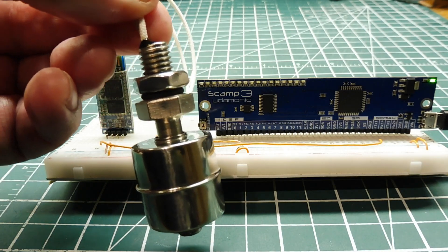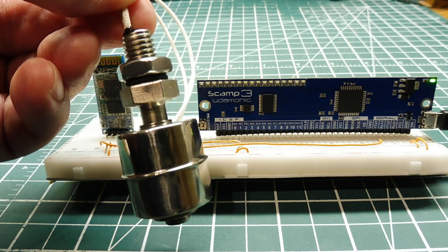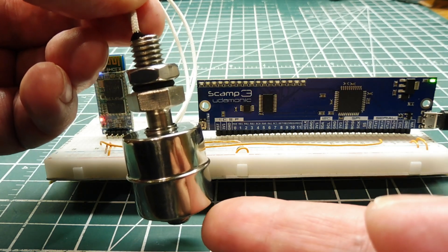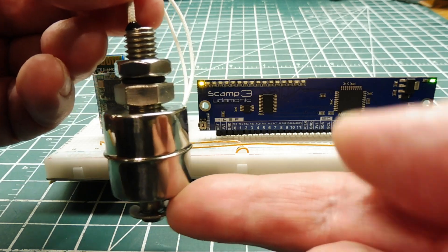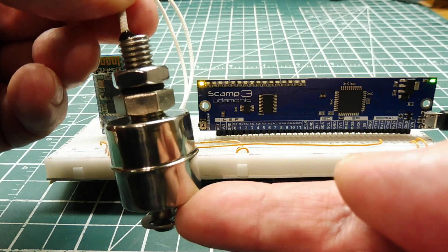The next alarm condition could be a flood sensor or water level detector. I have a little sensor here so when the water level rises it raises a float up. Watch the LED on the very left — as the water level comes up it triggers the alarm, and there's the LED coming on indicating it's detecting water level or flood conditions.